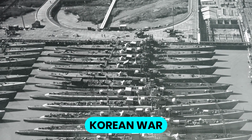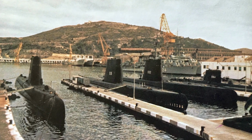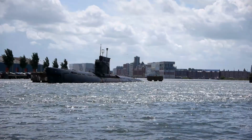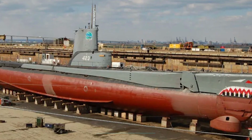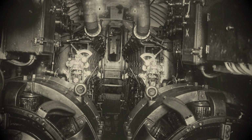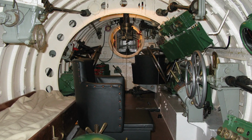By the Korean War, these submarines had undergone the Guppy conversion programs, and some of the major improvements included the replacement of 2 Sargo batteries with 4 more compact Guppy or Sargo II batteries, the removal of the auxiliary diesels, and the reutilization of below-deck space. Every Tench-class Guppy model submarine also had a snorkel, a way more streamlined sail and bow, and sonar, fire control, and electronic support measures upgrades. Their electric motor engines were also upgraded to the direct drive double armature type, which enabled the addition of modernized electrical and air conditioning systems.